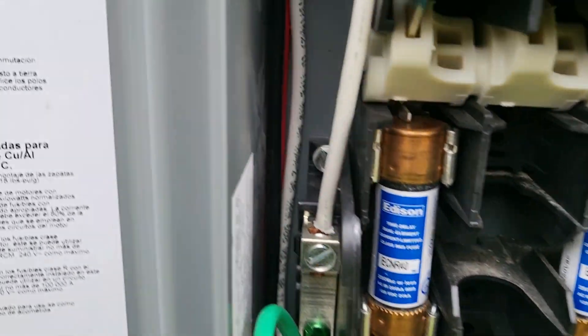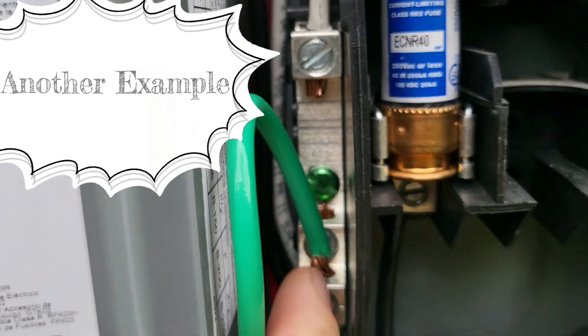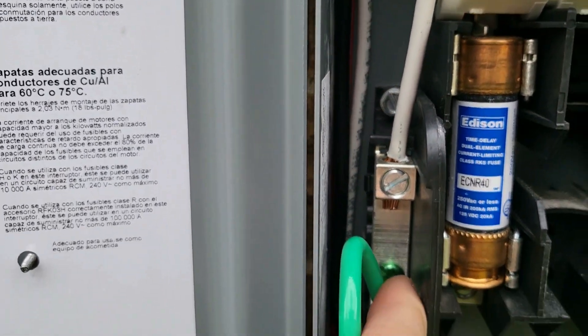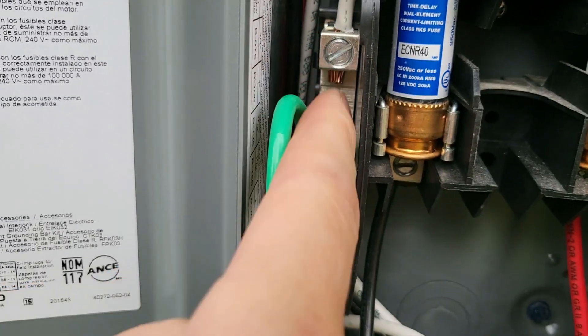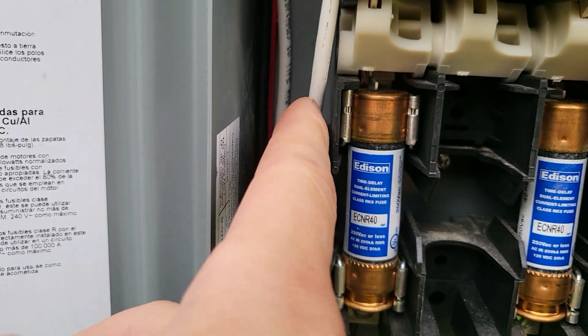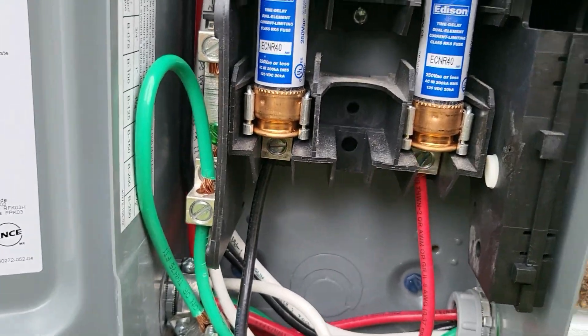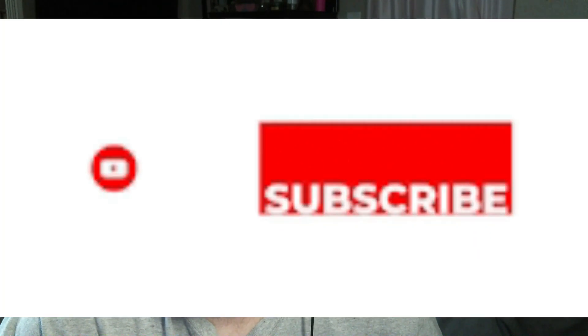Now you know what bonding is, how to do it reliably for a solid connection back to ground, what tools to use, and why we do it. Here's the fix: the grounds and neutrals are bonded right there with that screw and also right here with this wire. Leave this bonded so the ground stays bonded to the case. We're going to take our neutrals off and wire-nut them together — this connection point is just like one giant wire nut. Wire the whites together, leave the ground bonded. Easy fix — neutrals isolated, still bonded.